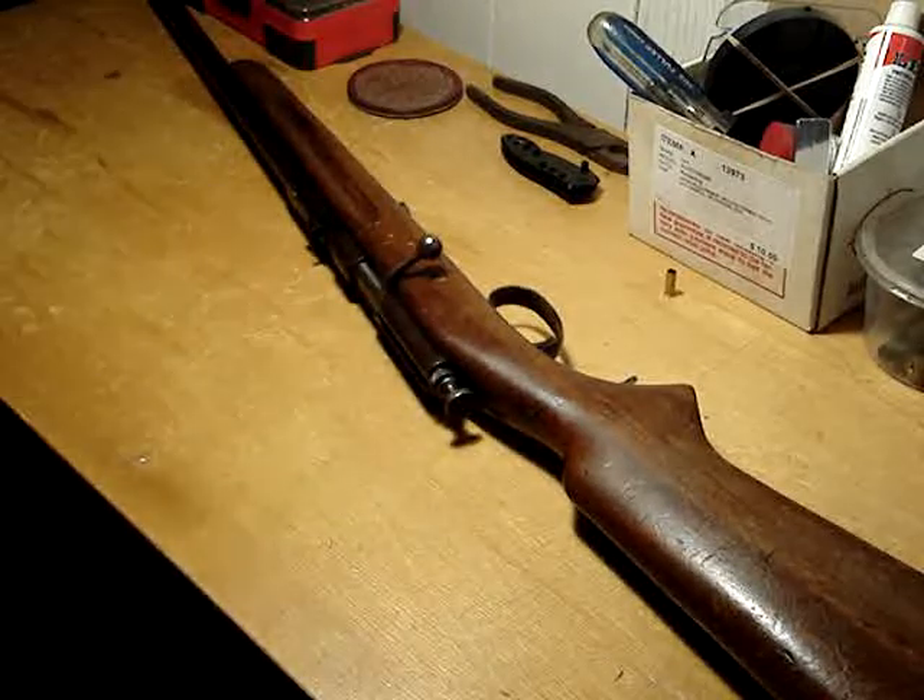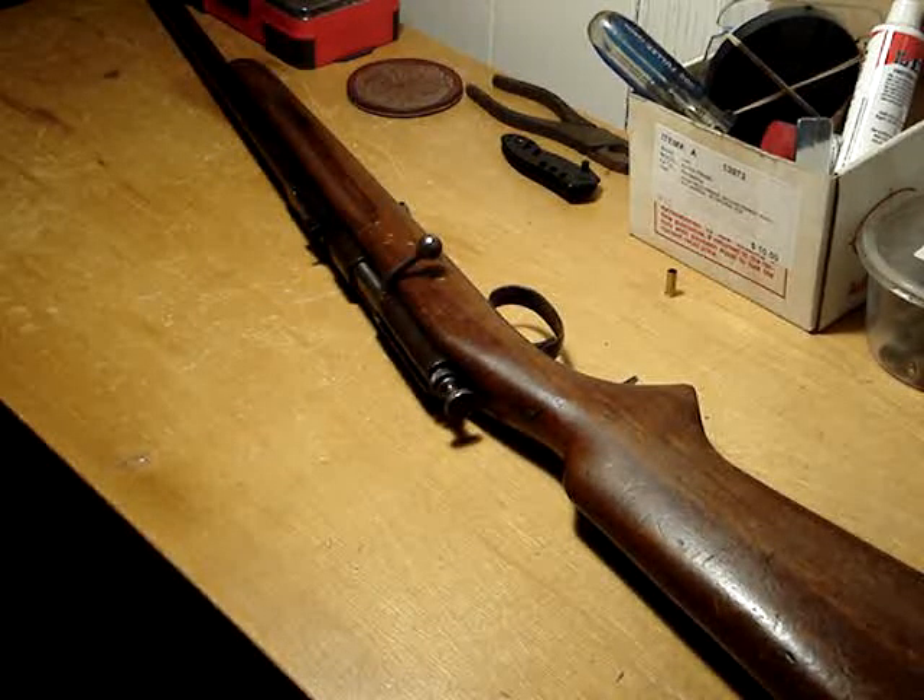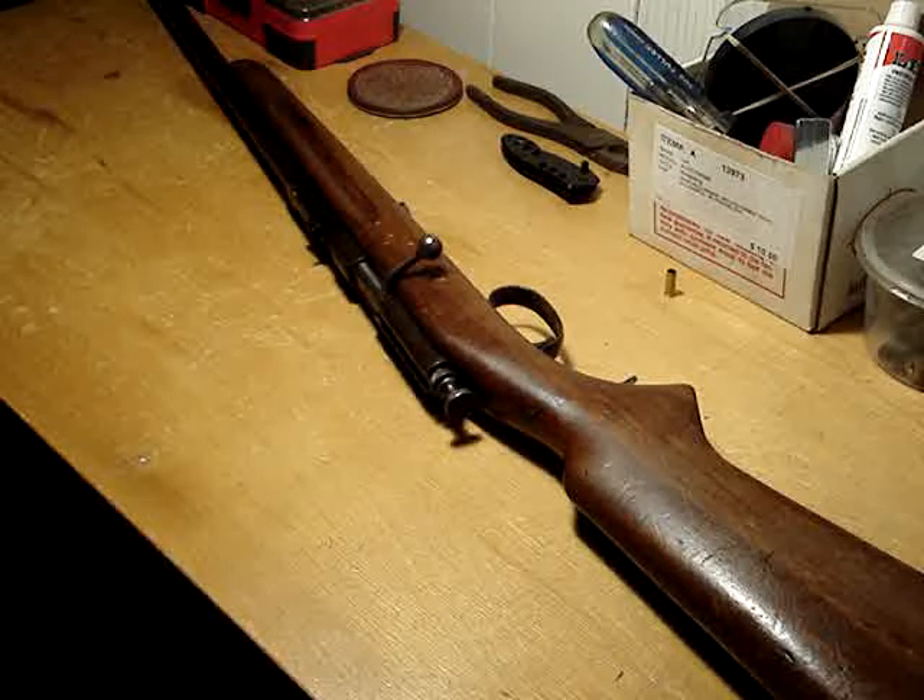It's the same sort of idea as a rebounding hammer on a single-barreled shotgun or a double hammer gun, where the hammers sit back and the firing pin is not actually bearing on the shell. On single shots too, if the firing pin sticks forward, the barrel has trouble opening and closing because it has to shove that out of the way.